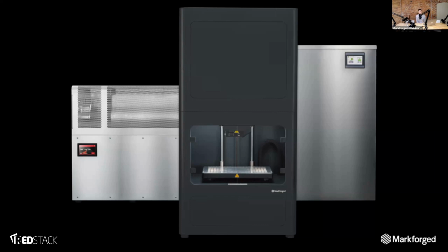Again, we started shipping it in about March or somewhere early this year. We've shipped, I think, about 100. We're on pace to ship more than 100 units by the end of the year. We have customers out there using it, and it's really exciting. The material they're currently using is 17-4 PH stainless steel. That was a launch material. Great general use stainless steel, precipitation hardened. Generally, as stainless steels go, it is pretty hard, pretty stiff, pretty robust, a little brittle, but overall a great first material.